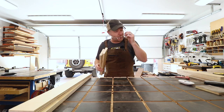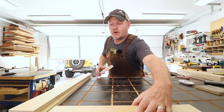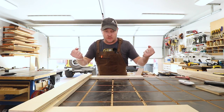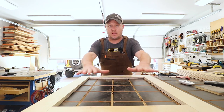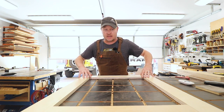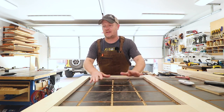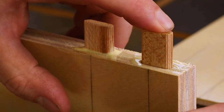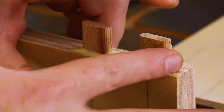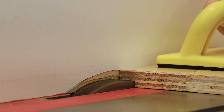Here's the thing I like to do with plywood projects like this to save some material and weight. I'm making two boxes that are both going to hold pull-out drawers. Those boxes don't need a solid panel bottom, so I've made the bottoms like a framework instead. This saves a lot of material and weight. I'm going to glue this up, throw a domino in the joint, run rabbets down the edges for my box sides, and then a solid top — a nice robust box that's also pretty light.